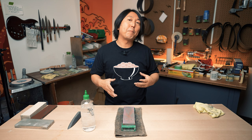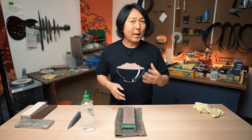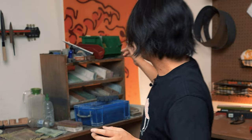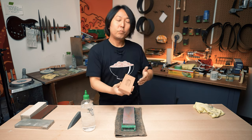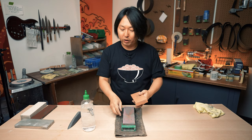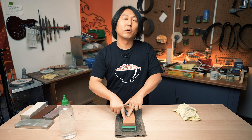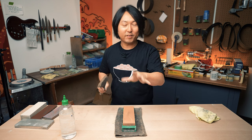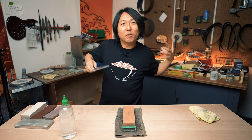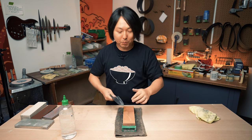From here on, I'm going to go up through different grits, like this 220 grit where I created the shape. If you are trying to make the bevel look nice, try to find a stone like this Knifewear 1000 stone that's actually really nice and soft. I'll show you how this works. I'll do a very similar thing, but I'm not worrying too much, especially when I'm working on a soft stone. A softer stone is like a cushion, like a bean cushion with super tiny beads that fit all around you. Softer sharpening stones wrap around the bevel a little bit more nicely.